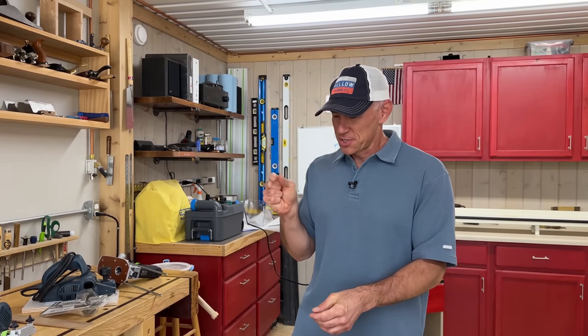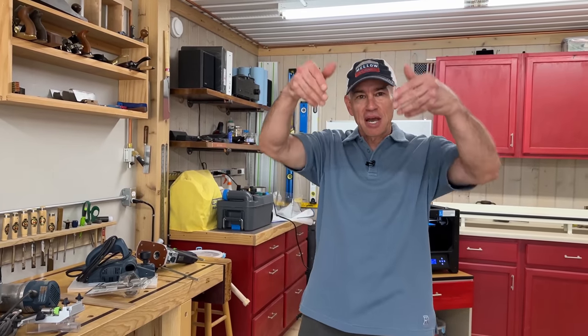Okay, welcome to day two after a disappointing day one. It was disappointing to get so close to being able to get that fridge in there and then not be able to drive it home. So this new fridge vents in a different manner from the old one. The old one vented largely by convection, drawing in air from the bottom and releasing it out the top. New fridge blows air out the bottom.